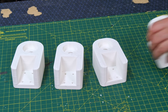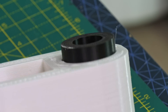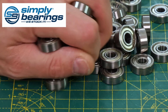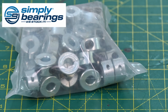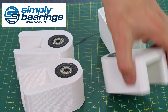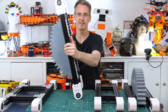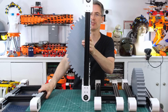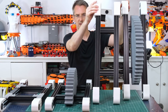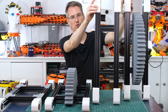It's time to put pivot points on the end of those long extrusions. These parts are printed with the 1.2mm nozzle with a recess for a shim printed with the 0.5mm nozzle, so I can make something tolerant that we can put bearings in — those fit back and front. Thanks to Simply Bearings for the bearings and collar clamps. There are around 160 bearings in total. The white ends go onto the double H-bar assemblies with the gear in, making half a parallelogram pivoting at the top and bottom. There's also a blank one without a gear to complete the full parallelogram, plus a thinner version for the bottom of the leg and inside the feet.